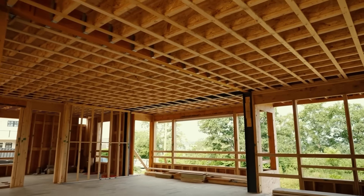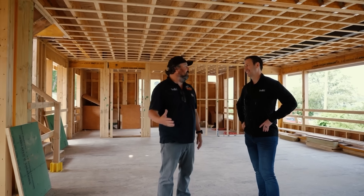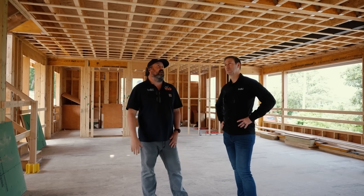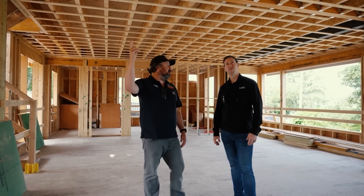Above me — I know where you're going with this — iconic New England! All the southern builders like me are like 'what the heck is that?' Yeah, one-by on the ceiling. Anytime you and I have talked about this or discussed it on social media, a lot of people get it, and we find other areas of the country — Miami, parts of Florida — where this is pretty common. But for the most part outside of New England this is unusual. What do you call it? Ceiling strapping, furring. It's a one-by-three — three-quarter by about two-and-a-half. You can get them in eight-foot bundles but we buy 16-foot bundles. It's not a big expense and not a big labor time sink either. It's stiffening up the floor system, allowing even floors, and giving the electrician a channel.